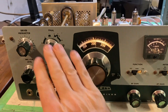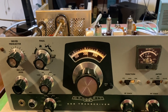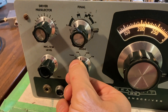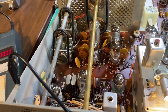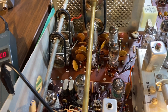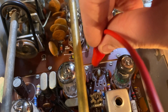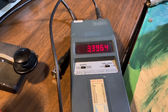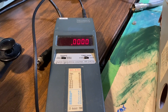I've been moving along — I've got the knobs on and I just put it through the alignment process. If you want to align one of these rigs, you've got to have a set of alignment tools, which I do sell on my website. And I'm noticing right away one conspicuous problem: there is nothing in lower sideband. I suspect it's a bad LSB crystal — it usually is. I've got my frequency counter hooked up with the black pin to chassis and red pin to the center pin of the carrier null pot. In upper sideband or CW I should have 3396. I switched it over to LSB — I should have 3393 — and it's dead.